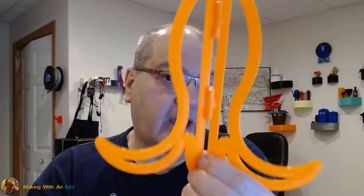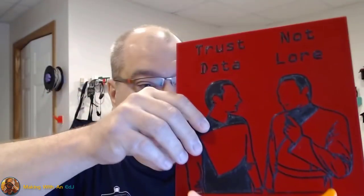I wanted to take it a step further by adding a design that uses user parameters in Fusion so I could do things like this without having to design a hinge every time I created a new model. Basically what I did was created this hinge, saved it as a separate Fusion file, pulled it into another design, located them in the proper place, merged them together, and got a nice print-in-place hinge that works really well and really smooth. This is one of those easel-style picture holders you can buy in acrylic or wood, very common design.